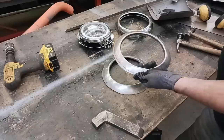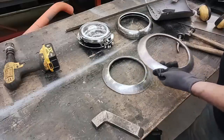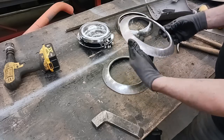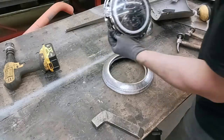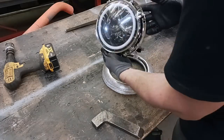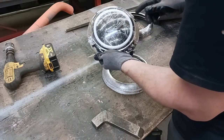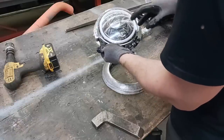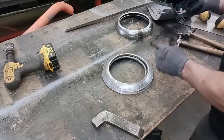So when the fenders get mounted on the car, we'll jump in, get these tacked on after we cut the flange out so that we have a butt weld all the way around the perimeter. And then we have our tabs for these headlights. These headlights, the tabs are actually different than on the 54. These are custom. Picked them up on the Jungle website. Quite nice. The chrome, who cares? We can black that out. The other thing is, these have the halo and the high and low beams, all that nice stuff. So we'll get them wired in when we get closer to the end.